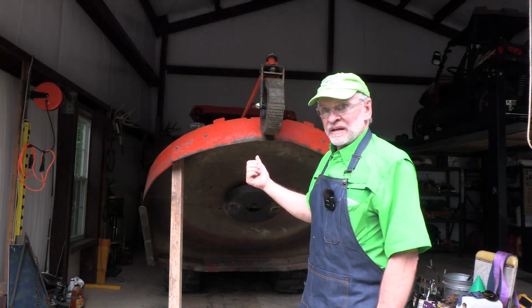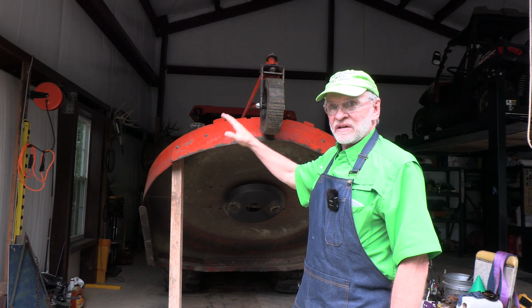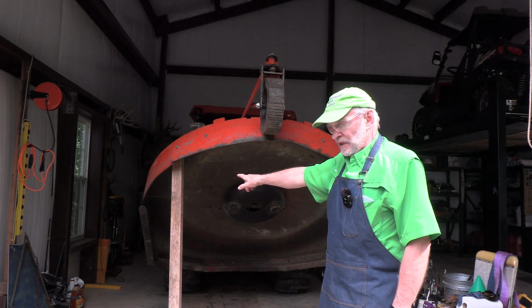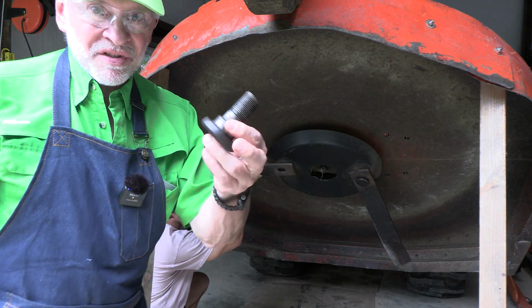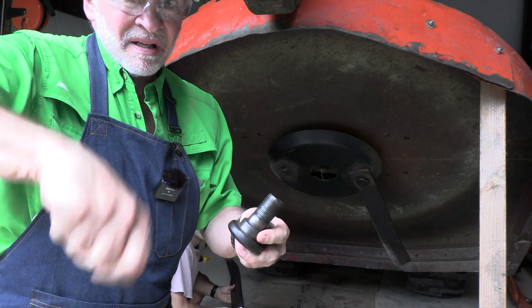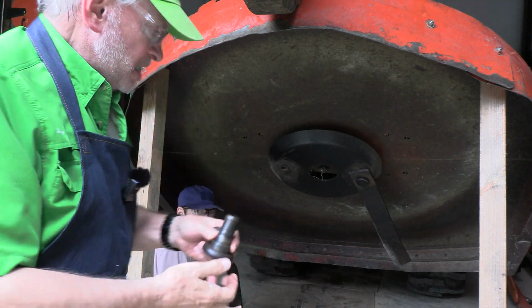Okay, we've got the bush hog brought up on the hydraulics. We've got some safety blocking here, just holding it. We're going to get the bush hog blades just started. Then we're going to lower this. This is a very dangerous part, be very careful. Please have security. You can't guarantee that the hydraulics won't fail. Please be careful. So here's the giant nut, giant bolt, giant lock washer, all cleaned up.